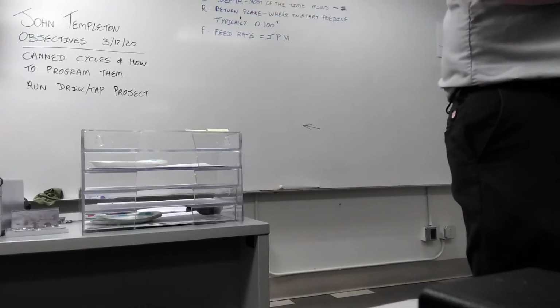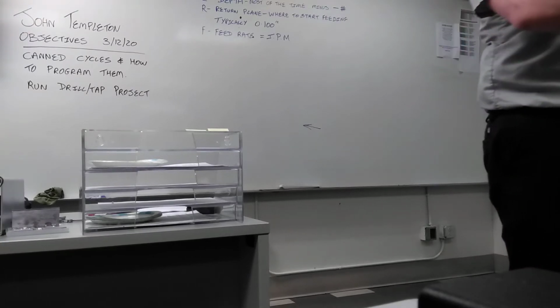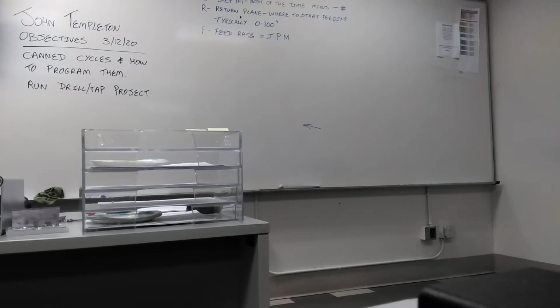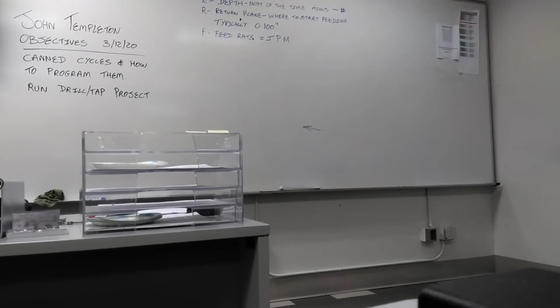All right. So again, on the page after, I've given you the page from the Haas manual. It has an example on there, but again, it doesn't explain any of the values. Have a look at line number 5. It says G82, you know what that means. Spot drill cycle. G99, you know what that means. Turn to the R value. You've got a Z, so you know how deep it is. What is P?